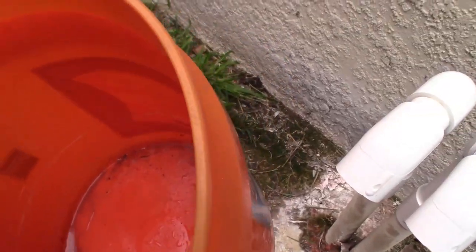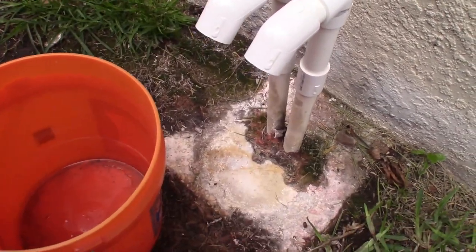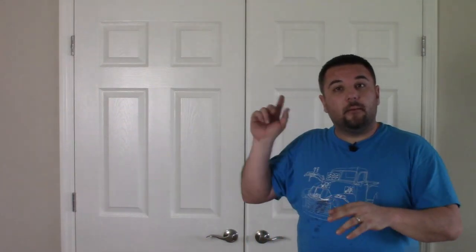If any of you have a better way of doing this or I'm doing something wrong, please throw it in the comment section down below. Just looking at the bucket — there isn't really much in it. I'm thinking we got most of the junk out when we used the vacuum. My air handler drains are now 100% completely cleaned out. That's going to be a wrap for this video. We got the air handler lines cleaned out for both the upstairs and downstairs air handler using the suction method as well as the compressed air blowing method. If you have questions, drop them in the comments. Please like, share, and subscribe, and I'll see you in the next video.